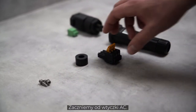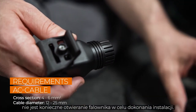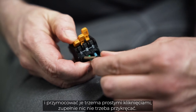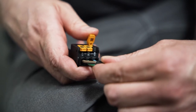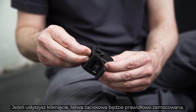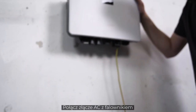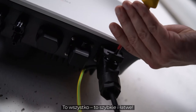We start with the AC plug. Because of our handy plugs, you don't have to open the inverter for installation. Simply pull the cable through the individual components and fix them with three simple clicks, completely screw-free. Make sure that all cables are fixed to the respective terminals. When all cables are in place, push the terminal strip into the housing of the plug. When you hear a click, the terminal strip is properly engaged. Last but not least, tighten the fasteners. Connect the AC connector to the inverter and fix it with an M4 screw. Quick and easy.